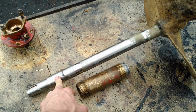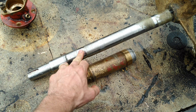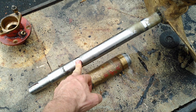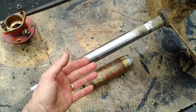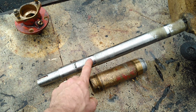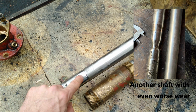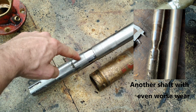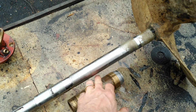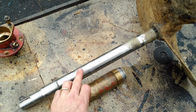This has served the boat well but it's just worn out now. The issue at the packing point is that in order to create a seal you'll be tightening up that gland more and more and it's just going to get worse. Ralph from the yard sent me a picture showing the original diameter compared to the current wear — you'll see just how much has worn away. It's almost down halfway, which is incredible. Unfortunately this will put stress on your gearbox bearing and output, so this needs to be changed.